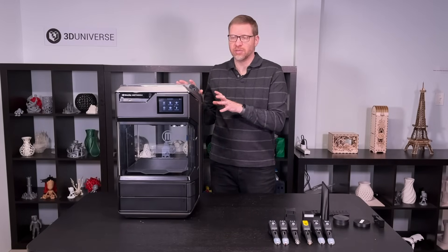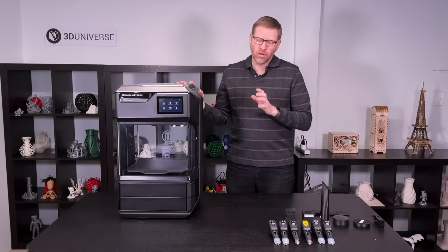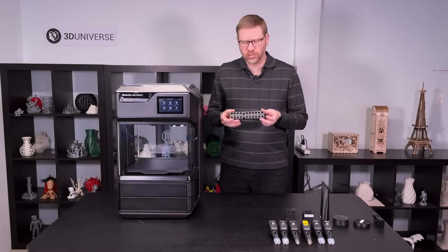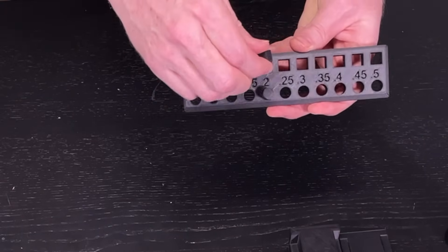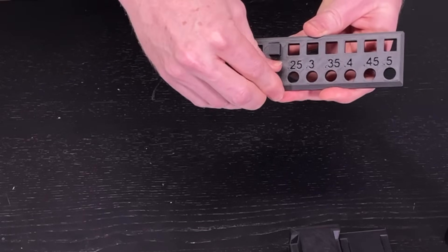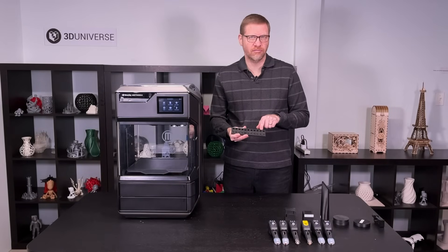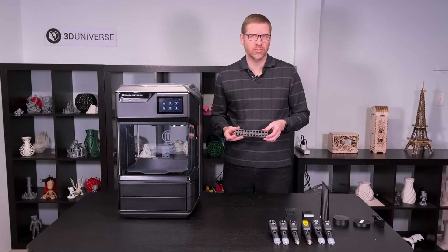In my experience, even using more advanced trickier materials like ABS and ASA, parts have been consistently of high dimensional accuracy coming out of this printer — within about 0.2 millimeters of spec in every case, sometimes even a little better. I did a dimensional accuracy test using a part available on Thingiverse where you print pegs and see where they fit to identify your level of dimensional accuracy. The result was right at the 0.2 millimeter mark, and parts could even fit at the 0.15 millimeter mark, though a little tight. Every other printer we tested came in at or above this, with most faring worse than the Method series.